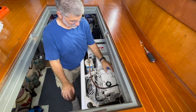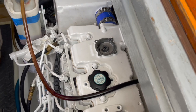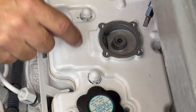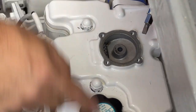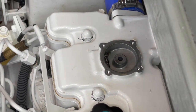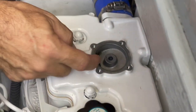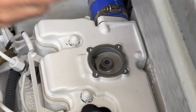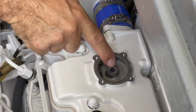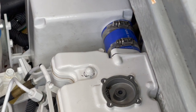I'm back — I've taken the four screws out of the ventilator and I want to show you how this works. Tracy's going to zoom in here. You can see a little wire mesh right here which separates this valve assembly from the valve train underneath the valve cover. This hole leads to the intake manifold. Underneath this rubber bellows there's a little spring — you can see it popping back. When in position, pressure builds up and pushes up the bellows, opening the passageway between the crankcase and intake manifold, and the natural vacuum in the intake manifold sucks those gases in.